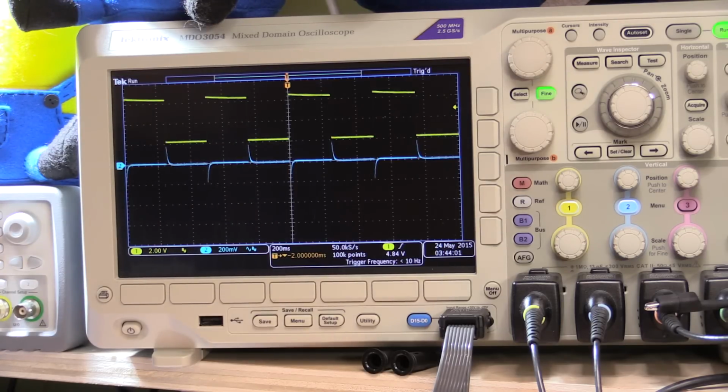Now if I take the capacitor that I put on the feed that goes from the summing junction to the integrator, what I did was put a 100 nanofarad capacitor out of the voltage differential amplifier, basically across the 132K that feeds the integrator. If I pull that out right now, it's out now. And of course, sod's law, it doesn't show any difference. Let me pull out the other one as well, because that should now make quite a difference. Right? So what you have here now is this ringing occurring.